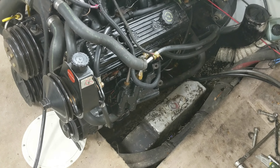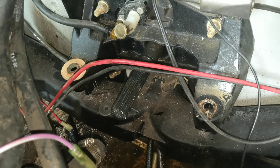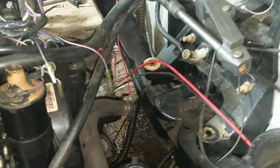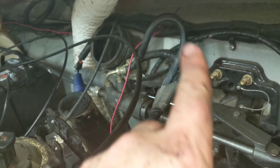Looks like I was right - take those two bolts out of each mount right there, see those two that are gone. They're lag bolts that go down into the stringer. You get those out, then those two larger pins I already pulled - with those out it's just splined in, so it just cruises right forward. I was putting a little pressure on it and sure enough it started sliding. We've got probably a foot gap there now. If you were going to do anything with the transom you could probably do a lot right here without actually pulling the whole thing out.